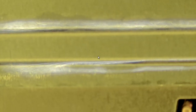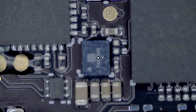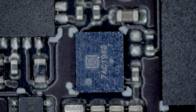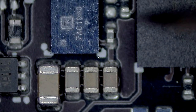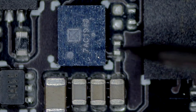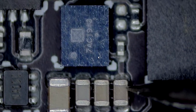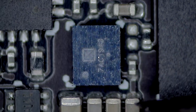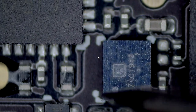There's also another device here — some sort of chip-scale packaging with a Square logo. I don't know what this device is. It's some sort of BGA, and you can see connections to a whole bunch of capacitors. Maybe this is something to do with backup power — though it would be unusual to have a custom IC just for backup power. Anything that's a custom device is of course going to be interesting.